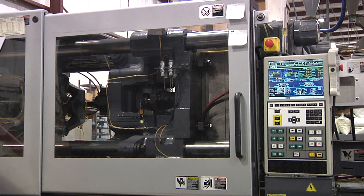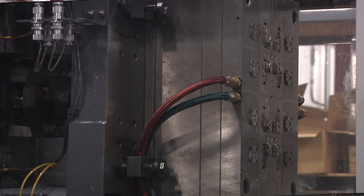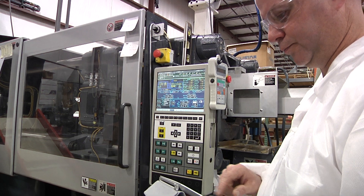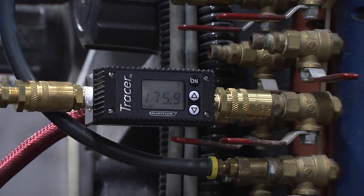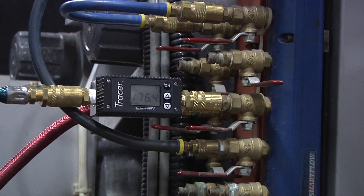The principle of scientific molding seeks to optimize molding efficiency by measuring and recording molding process parameters to the greatest extent possible, providing an effective means of easily repeating a successful molding setup in any molding machine. One of the key elements of the molding process is mold cooling. In fact, experts estimate that mold cooling time represents, on average, 80% of the molding cycle.